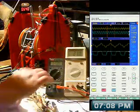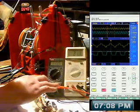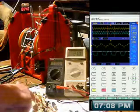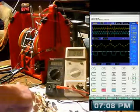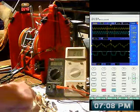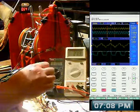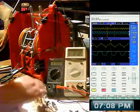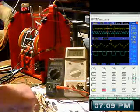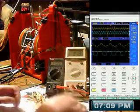Yeah, so one thing this is telling me, the way I'm working out this circuit right now, is how I need to design a circuit board. So basically what I'm going to have to do is have a trimmer pot in series with this capacitor that I've put on the gate. That way I can trim the delay of the gate triggering, and I can tweak it. At the moment there's not much room to put a trimmer in there, but I'm wondering if I can get this other trimmer in there.